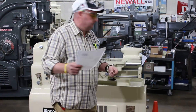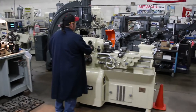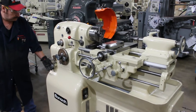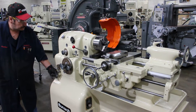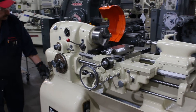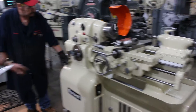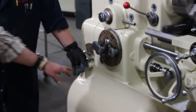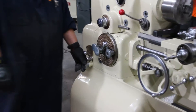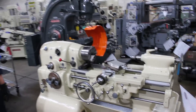Go ahead, Frankie, let's see what you've got. The spindle speed RPMs on this machine range from 1 to 2,500, infinitely variable. You'll notice how we change the speed slower and faster off of the dial right here — that's the nice thing about the infinitely variable setup. The machine is a Monarch 10EE, therefore it has 12½ inch swing over the bed, 20 inches between centers. It's currently set up with a 6 inch 3-jaw chuck — that's a new Gator, fresh out of the box.